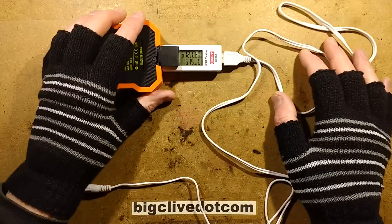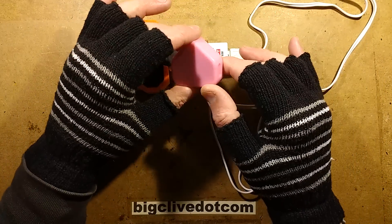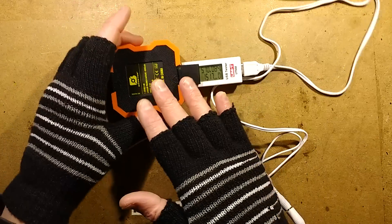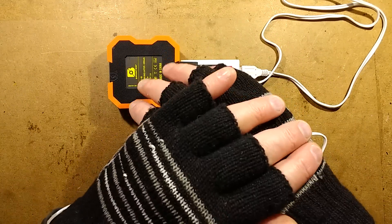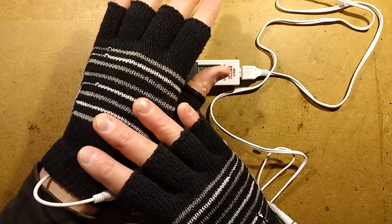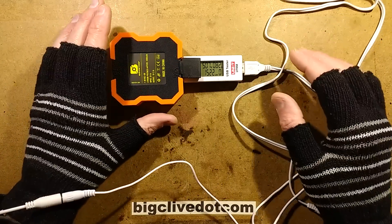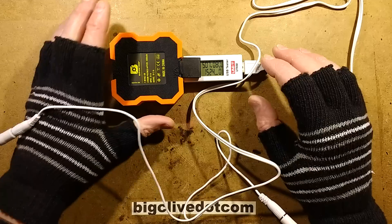I've been trying them out, and regarding the power they draw — I wouldn't recommend plugging them into any cheap USB power supply. They require at least an amp, but more importantly you want something that is electrically isolated, which means a power bank is maybe a good option, although it's going to deplete it quite quickly at a one amp load. The main thing to note is that inside these there are little heating pads, and the wires onto them are only separated from your skin by a thin layer of Tyvek fabric. So from an electrical safety perspective, don't plug them into a crappy power supply, otherwise you could have a nasty experience.